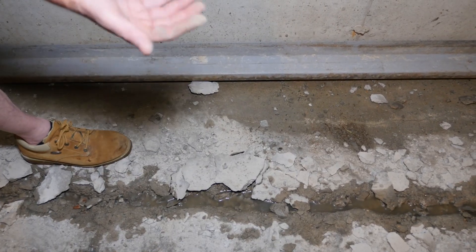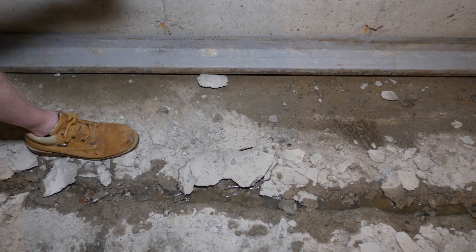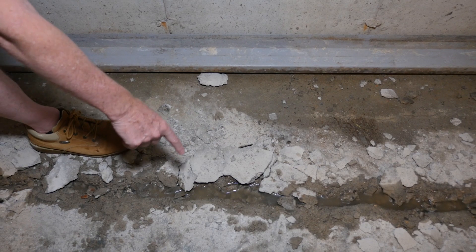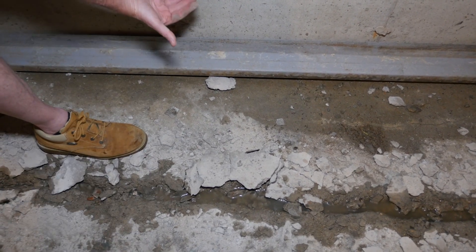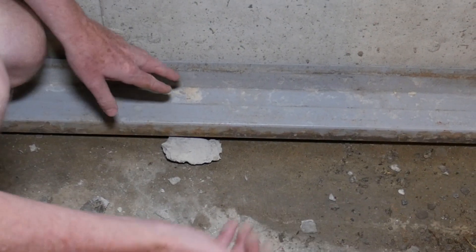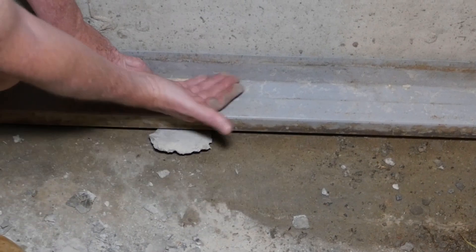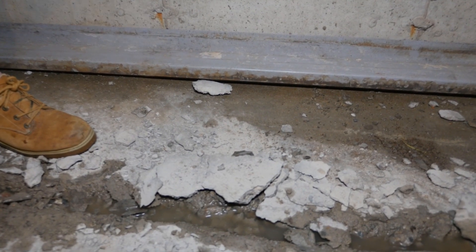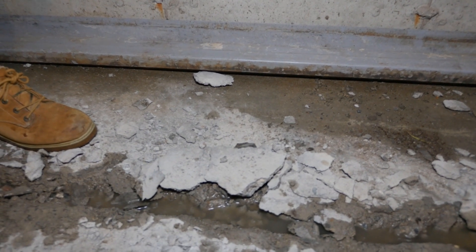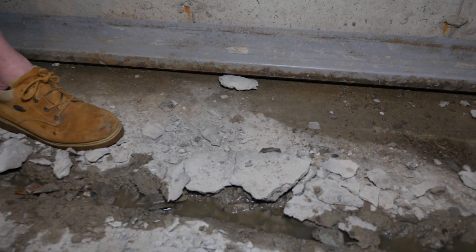Water is coming right up through the area where we're breaking up the floor — that's hydrostatic pressure, that's water pushing up on the floor. Now this water, if it were going to get over to this system, would be sliding underneath the floor to get over to the drainage. If you create a release of pressure underneath the floor at one end, water is going to flow towards that release of pressure, and in doing so that can disrupt the support you would have underneath holding up your floor — it can actually create a situation where the support of your floor would be jeopardized.